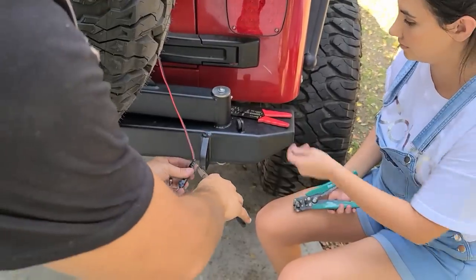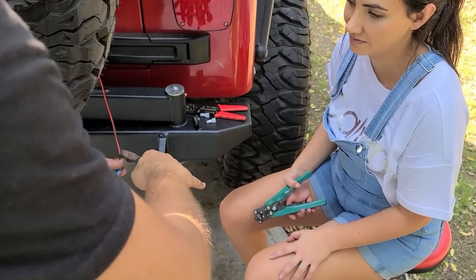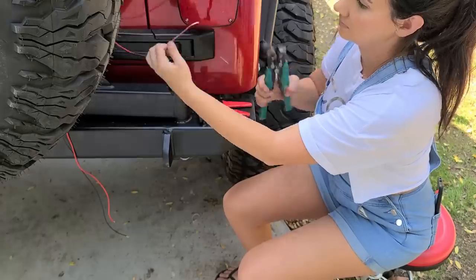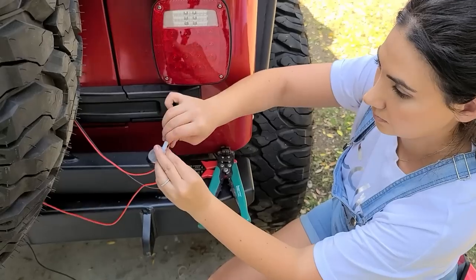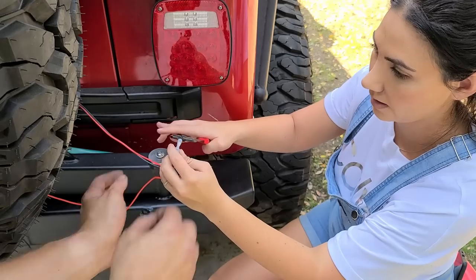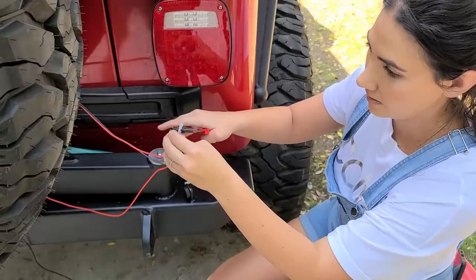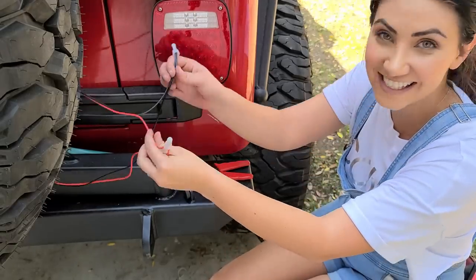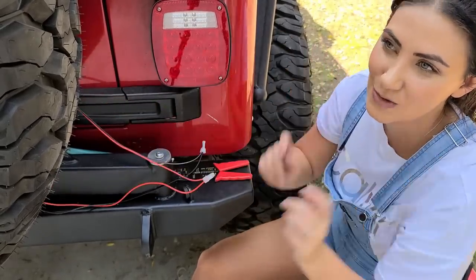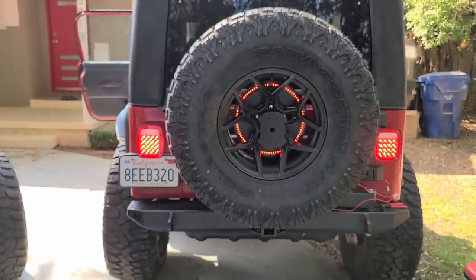Going to do our wiring — I'm going to cut it right here. Just want to verify that when I wired this I did it the right way: black to black, red to red, red to white. And it is. So we're going to cut this here and connect red to red and black to black. We're using these outdoor-style waterproof butt connectors, making sure all of the copper is exposed. Give it the tug test. Time for the black — easy as that. If I could do it, anyone can do it. You guys can DIY all day at home.